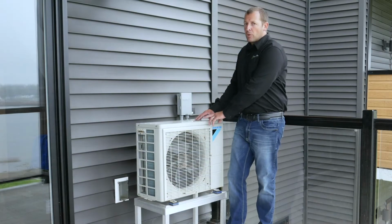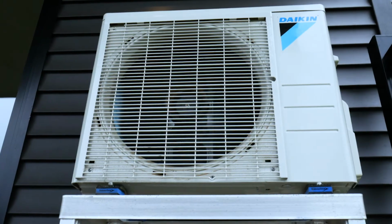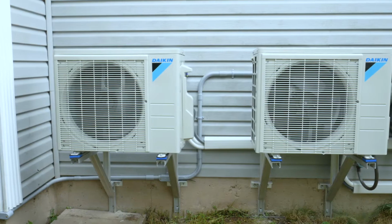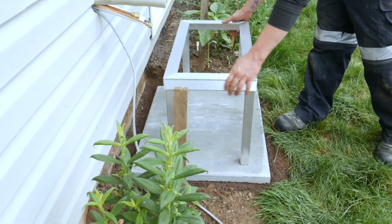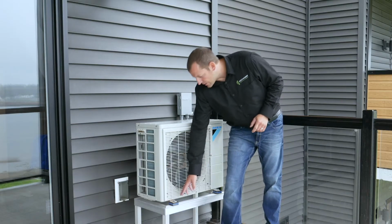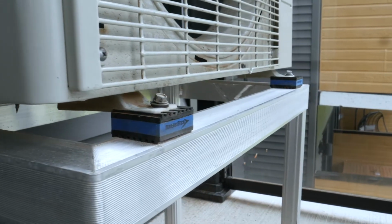The outdoor unit of your Daikin AURORA comes with a durable factory finish, mounted on these aluminum stands to resist corrosion. There are many configurations of the mounting, some on the exterior exposed concrete wall, while others are placed on stands that rest on leveled concrete slabs over a layer of crushed stone. In all cases, they are mounted with these rubber pads to reduce the noise from the vibration of the unit.